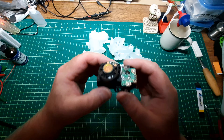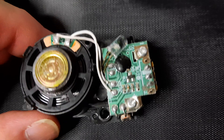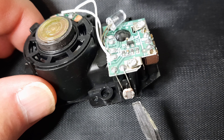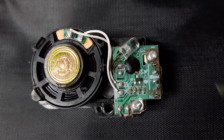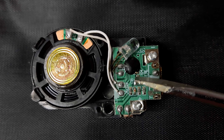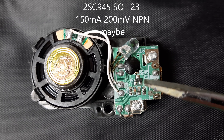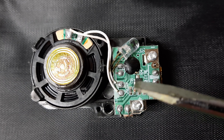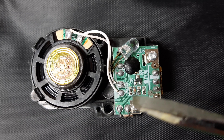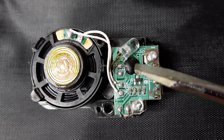Probably should pull it back together. So here's the board close up. On the side here you've got the photoresistor that determines when it should activate when the light has changed a bit. We've got our mystery blob chip here. We've got an NPN transistor here. We've got our speaker over here. And the switch is here. Three resistors, a capacitor there, and a really tiny decoupling capacitor over here close to the blob.